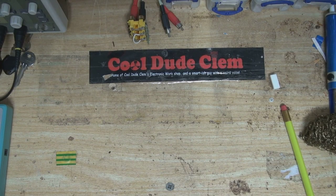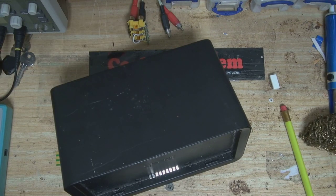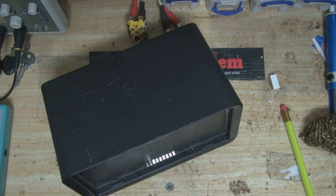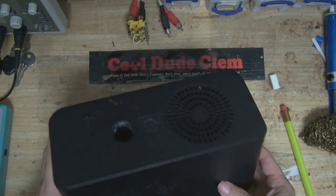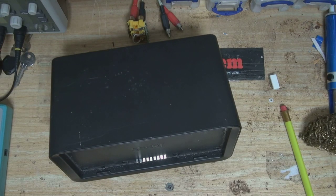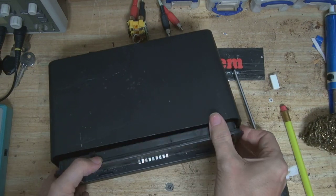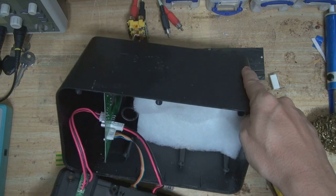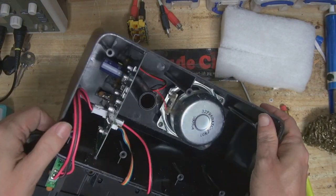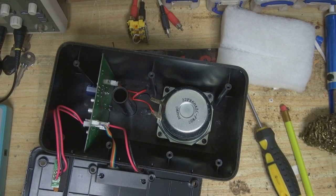I've been digging around in my shed and I think I found a suitable donor for parts, which is this contraption. This was a subwoofer of something — something was supposed to snap into the front here, probably a phone. It's more of a sub-yapper really. There's the actual speaker in there. If I could take the amplifier out of this and reconfigure it so it's a full-range speaker, it should be just fine — it's probably on a TDA 2030 or something like that. But when I opened it up, it looks like a Class D affair, and it's probably got automatic turn-off if there's no sound, so that was a bit disappointing. Looks like a pretty good speaker though.